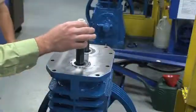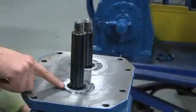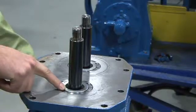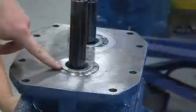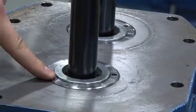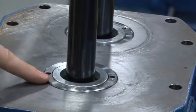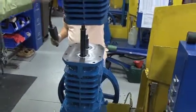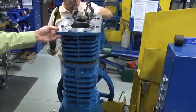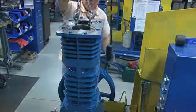Remove the packing box installation tool. Finally, check to ensure that the packing box is installed correctly. Rotate the flywheel back and forth, watching the packing box for any movement. If the packing box is correctly seated, it will not move. If you see any movement in the packing box when manipulating the flywheel, as shown here, it is improperly seated — remove the hold-down ring and packing box and reinstall. You are now ready to reinstall the cylinder head in the reverse order as described earlier. This concludes the packing replacement process for a Blackmer LB601 reciprocating gas compressor.